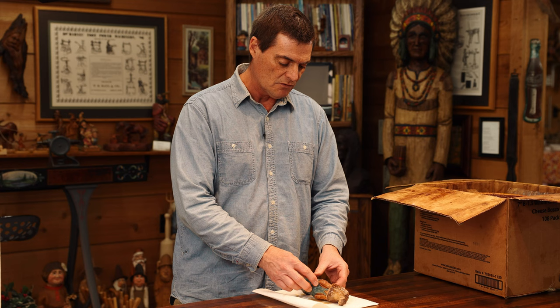While we're letting this set, I'll tell you the recipe I use — it's very simple. It's boiled linseed oil and odorless mineral spirits. I mix those two together in a gallon bucket, then mix it up really well. You can mix it in a blender or hand-stir it, but a blender is more effective — it breaks down everything and gives a good flow. Then I add about an inch or an inch and a half of burnt umber oil paint, put that in, and mix it up really good.